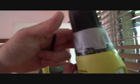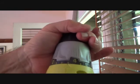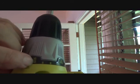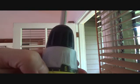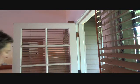And drills have that. So if you hear your drill chuck like da, da, da, da, like that, you just tighten it up. See, if I have this on low, I can hang on to this and it's going to chatter. See? You get like that and you think, man, I can't tighten it up anymore. What's the deal? Just tighten this up. And see, I usually keep it, see that line there? That's for drilling, like for drill bits and stuff. I usually keep it just beyond that, just behind that. So I have it at 22, and I could do it at 23, okay? That's how you do that.